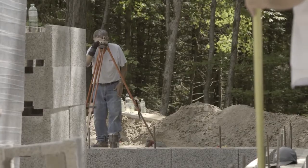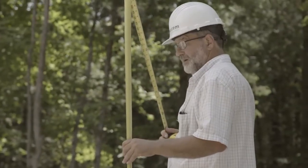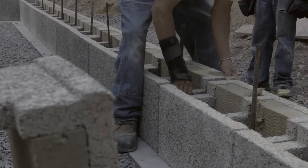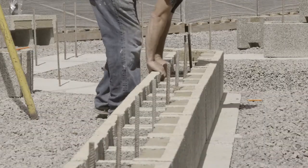Hi, it's Tim from Nexum. A little bit of advice about how to get started and what you want to achieve in this first course. There are going to be variations in your footing. You're going to be off a little bit, so take that extra time to make them straight and plumb, and just know where you're at. Know where your variations are and have a plan for how you deal with them. If you don't, you'll get up 10 blocks high and wonder why your wall is crooked, and then you're doing extra time trying to correct a problem.